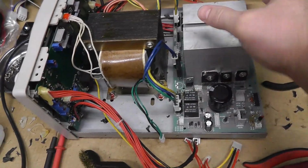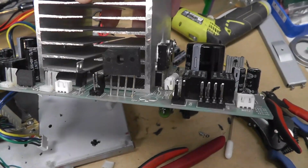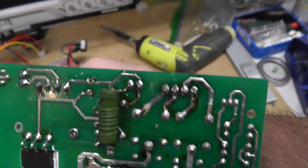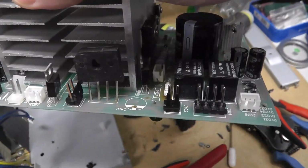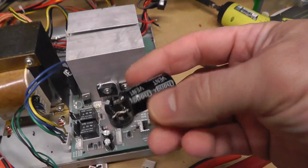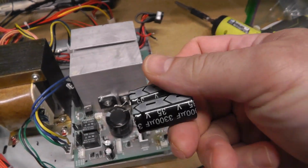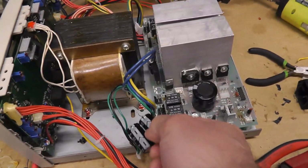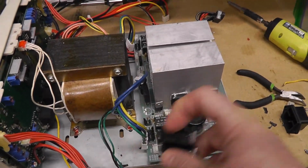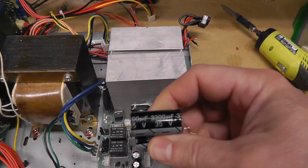Alright, I got this thing already repinned out with new connectors, as you can see there. And I actually moved that resistor to the bottom side. It looks like it was on the bottom of the other one that I have. And I have not added C401 back in yet. I'm going to crack open the first one, device number 1, to see what rating of caps they had, and see if I need to maybe rig something up like this and wire it over and hot glue. That's so crazy that they probably used the wrong size caps, or they didn't have them or whatever.